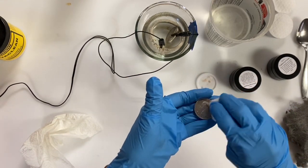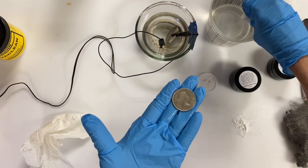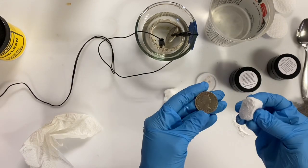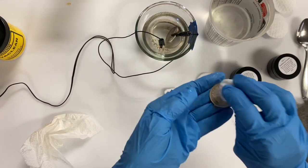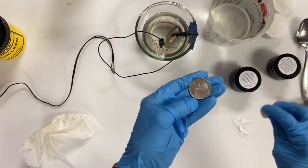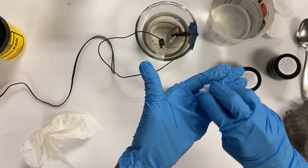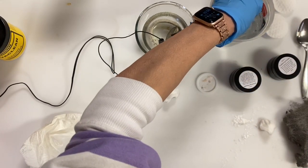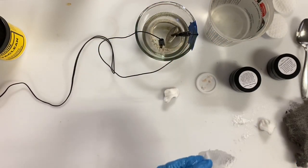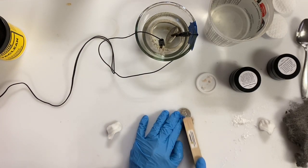The next step is the brightening powder. You'll see the piece is silver but doesn't have any bright shine yet — that's where the brightening powder comes in. It brings out the more white tone of silver. Once everything is applied, rinse it off and dry with a paper towel. Then use a brass brush to buff the surface to a nice shine.